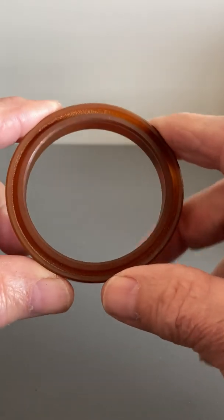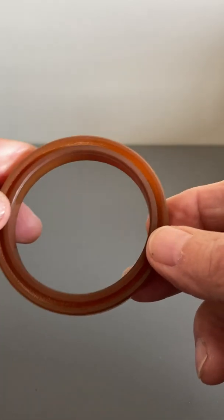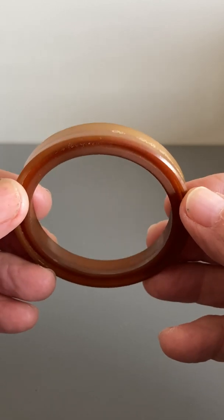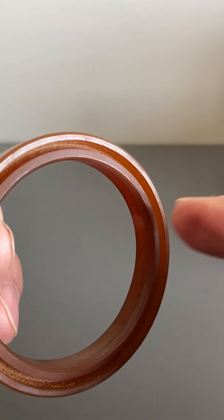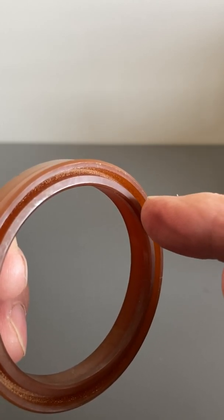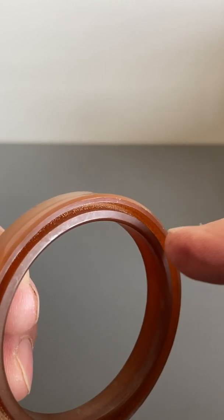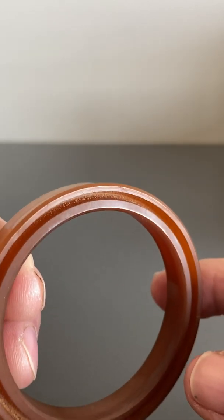This is an old seal. You can see that the properties of the seal would be flexibility — it's quite flexible. This is polyurethane, and it should be able to resist a high tensile and compressive force, and it should obviously resist the action of hydraulic fluid. If you look closer, you can see there's a tapered recess all the way around the outside so that when the hydraulic fluid is pushed into that recess, because it's tapered, it forces the outside up against the inside of the hydraulic cylinder. So the higher the pressure, the higher the force pushing this outer part of the seal onto the cylinder walls — and that's how you get an excellent seal.